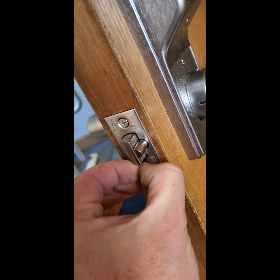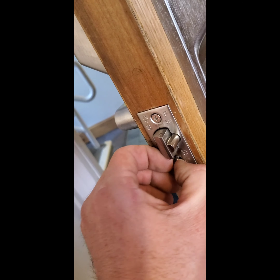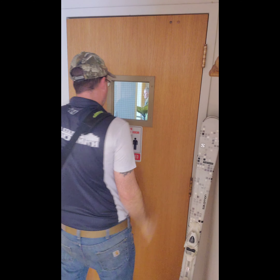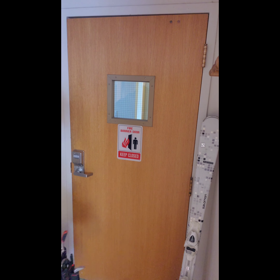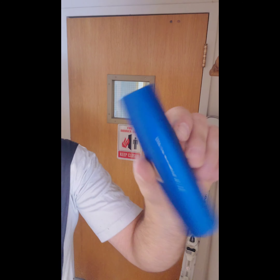Now I'm demonstrating a stripped screw. GKL Products makes an oversized screw with the same size head that will seat down in there and take that slack out of the hole. You could also stuff some chopsticks, pieces of wood, doweling, golf tees, or toothpicks — anything to help tighten that up. But if you're here, you might as well go ahead and fix the problem properly. Don't ever leave stripped or nasty screws after you've been there. You're a professional installer — you need to be fixing all of the problems.